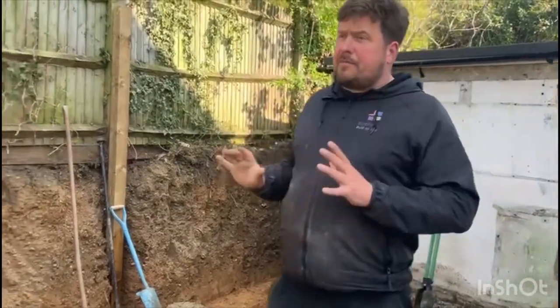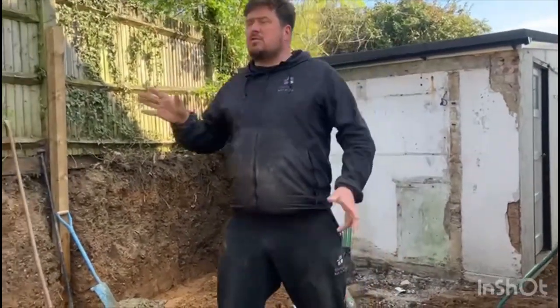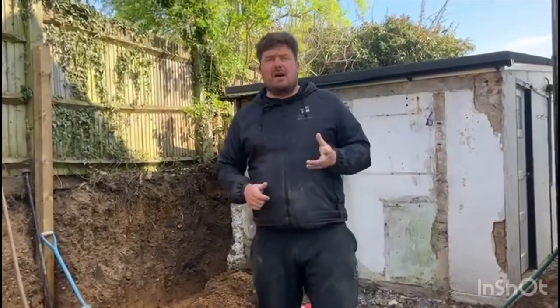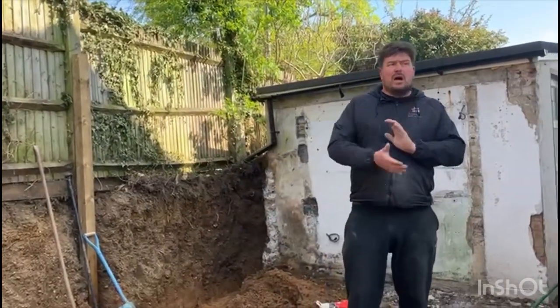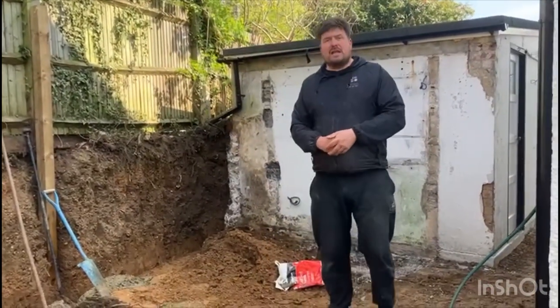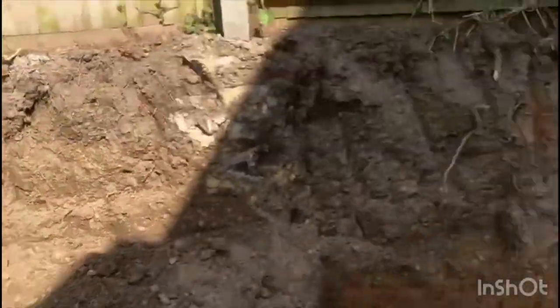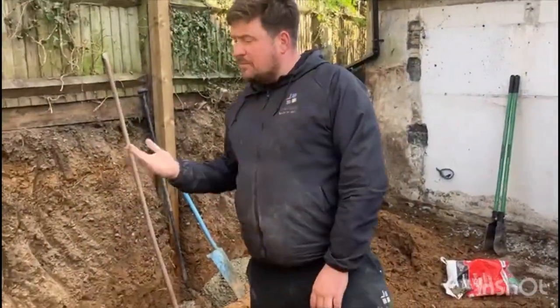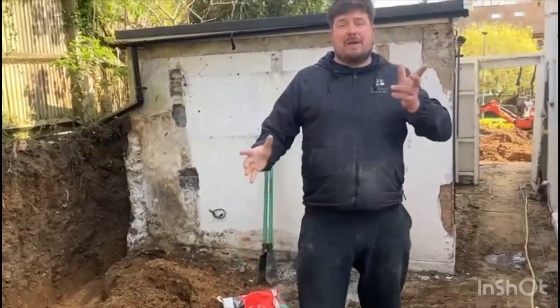Hi guys, we have basically prepared all of our area — everything's dug, just the last few little bits to get through. We've started to get the concrete in because we're aware it's near the end of the day and we want the concrete to start setting over the weekend. It's Thursday now, so it gives it time to set. You can see we've got some nice steps here — we've dug the footings extra lower and extra wider for stability, for the concrete blocks going on. The footings are going to come up higher than the prepared ground level, and then we're going to be putting a sheet on top, then groundwork with the concrete base, and then sand, cement, and slabs.